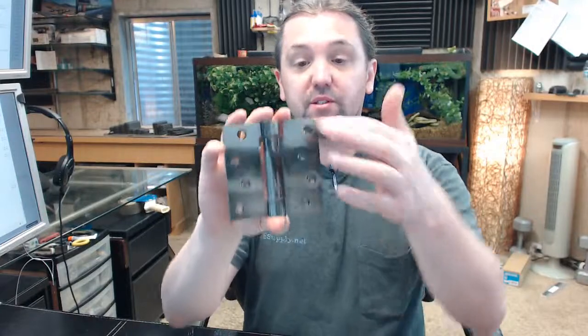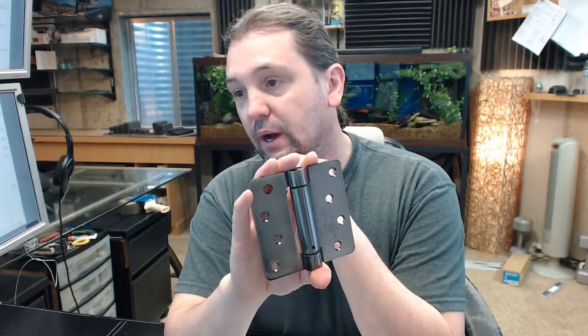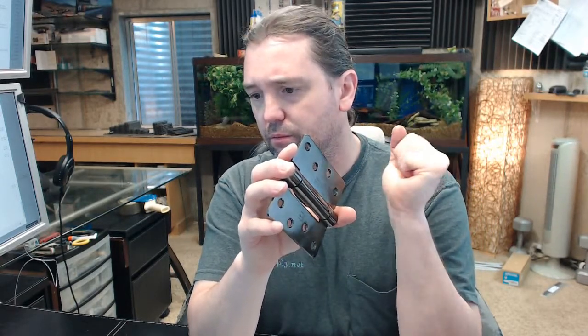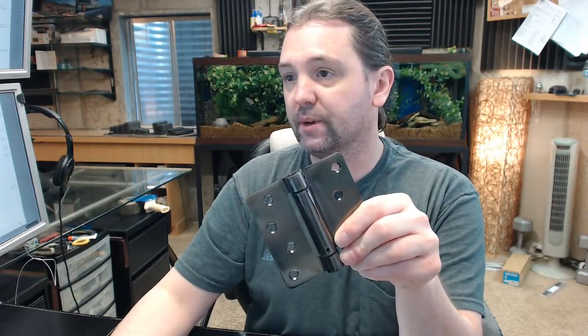The problem with the so-called zigzag pattern is that there are lots of them that are a 16th or a 32nd of an inch different, and they unfortunately don't make it simple to determine which zigzag pattern you have. If you have trouble determining yours and you were to call, I would say send us a sketch — locate all of the screw holes and let us know exactly where they all are, and then we'll work backwards to determine whose hinge you have. The template calls out all dimensional properties, including the thickness at 97 thousandths, and allows you to determine if this is the correct hinge.